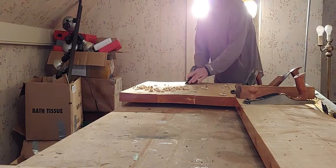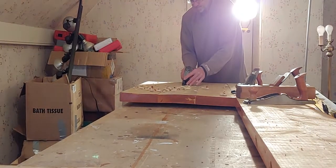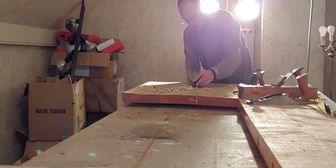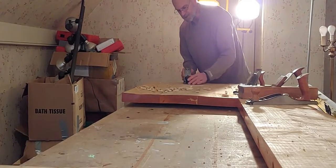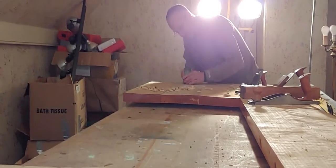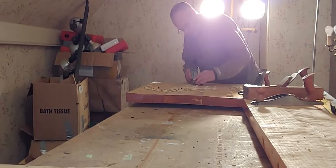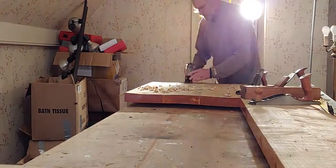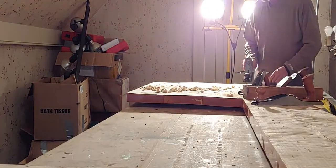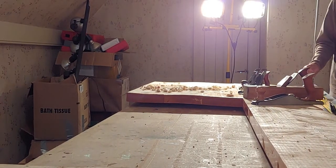Let's hit some other planes here. Let's try the handyman on it. I have this set up for finishing. You can hear it running across the scallops — I'm just going to take the scallops out of it. It's almost perfectly smooth.